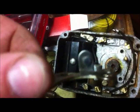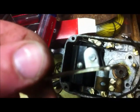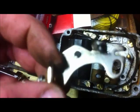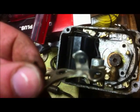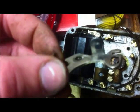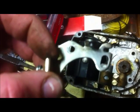I took the wire wheel on my Dremel tool to them and they polished up pretty good, but there's some pitting in there. I'm going to try to hit it with the file for a little bit and see if we can get the pitting out. It's fairly deep so I'm not sure I'll be able to get it out, but I'm going to try.